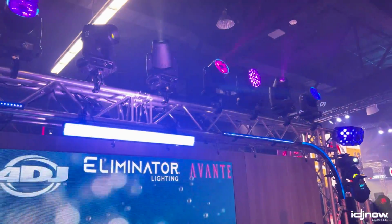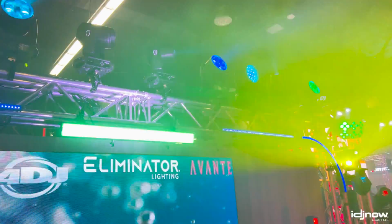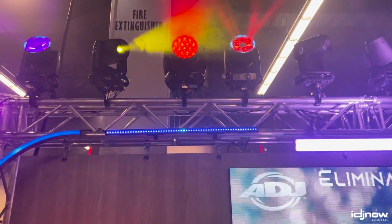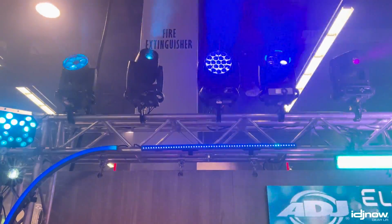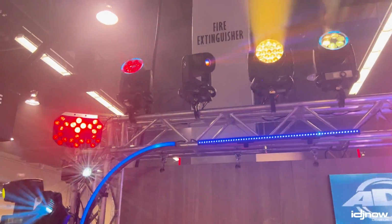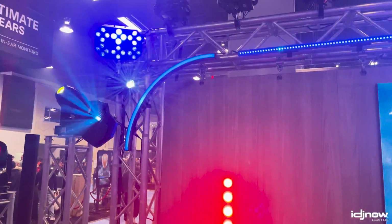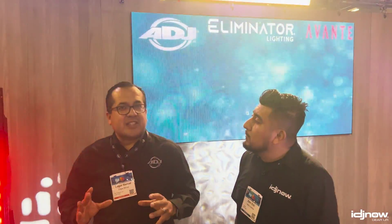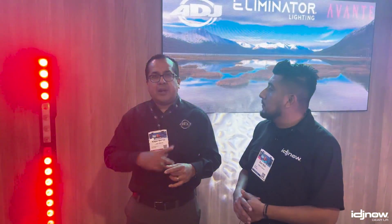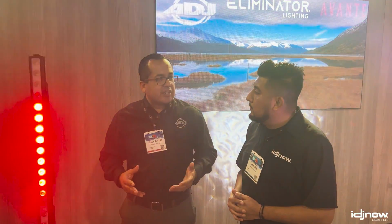The Stryker Max is actually 6 by 40 watts with red, green, blue, and white. And the lens actually rotates to create a very nice, powerful moonflower effect. You do get zoom. It can go from 9 degrees up to 40 degrees. And with that, you also do have an LED ring. So for some really nice eye candy effects, there are some awesome built-in programs, or you can control that ring with DMX.